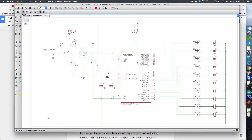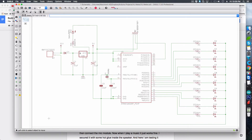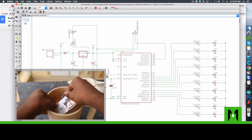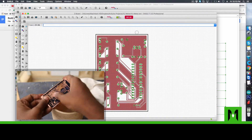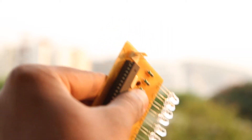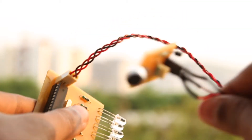Time to build a board. Again, I used Eagle CAD to design the schematics and build the board. I used the ATmega328 chip as the brain in between. Because the input will be 12 volts, I used a 5V voltage regulator. Finally, I etched the board — if you want to know how to etch PCBs, please click on the link below. Here is the board with the components soldered. I designed these boards to be modules so I can attach and remove them whenever required.